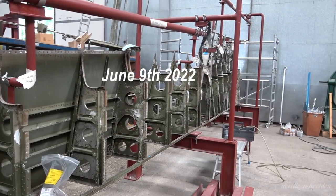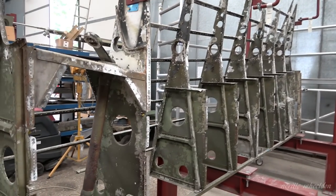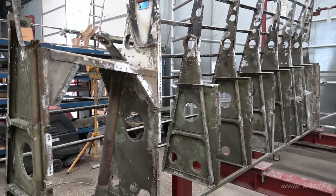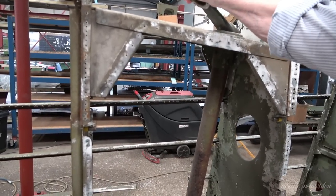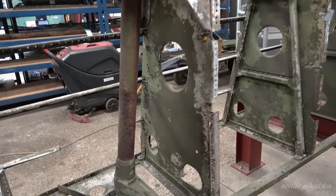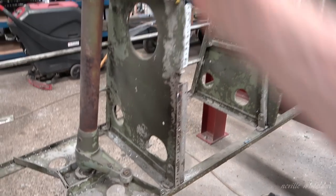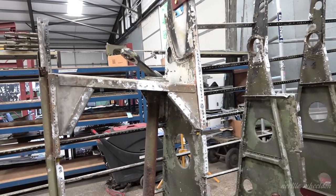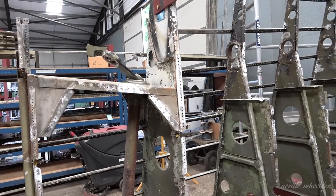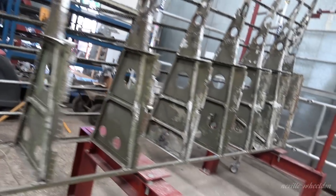Dennis is working on the trailing edge of the French wing. There are two top skins left to remove, then the remaining stringers and ribs. These will be soda blasted and checked for corrosion and damage. It does move slightly. We're going to start taking that out as a unit — the next little job. We're getting there now — looking good.